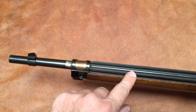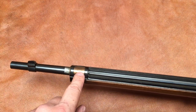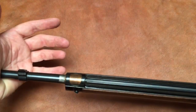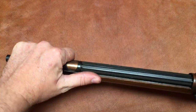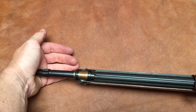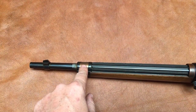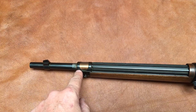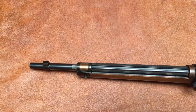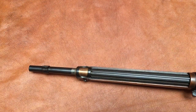Moving to the front, we have a fairly heavy finned barrel to improve cooling, and then it's got what looks like a brass sleeve that the barrel actually rides in, so that as the barrel cycles back and forth you want one replaceable part in this system of moving parts. By using brass, you ensure that the brass takes all the wear, and if it gets too worn you can replace it without worrying about the barrel or the stock attachment being worn out of spec.